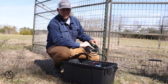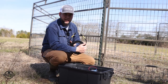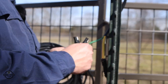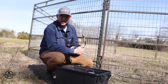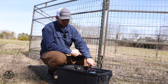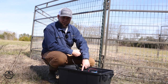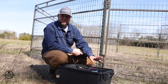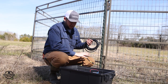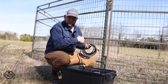One of the cables included with your Hog Eye camera is your power cable. Everything on this system is color coded — yellow to yellow, green to green, blue to blue, and black to black. If you find yourself plugging something into something that doesn't match, take a step back and reevaluate. Always put your red to the positive side of the battery and your black to the negative side. Take this power cable and thread it through the hole on the side of the box so cabling doesn't lay on the ground.